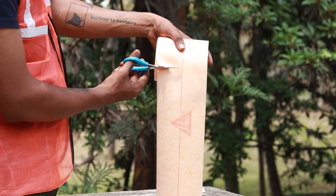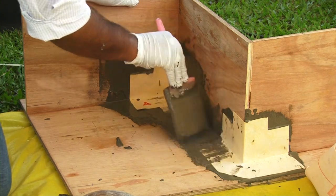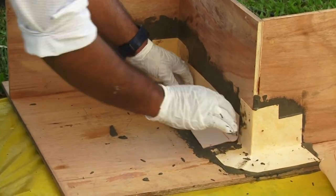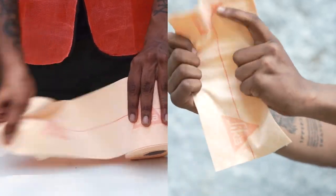It's easy to use: cut to size, embed in the first layer of Sika waterproofing, make a loop for movement and apply a second layer. Sika Seal Tape F is highly elastic and strong, making installation a breeze.